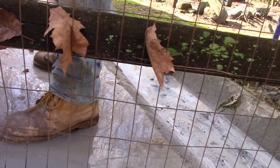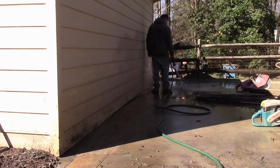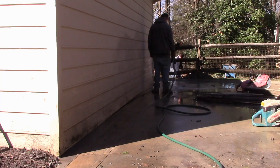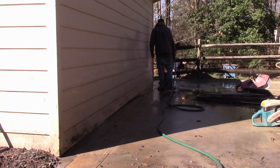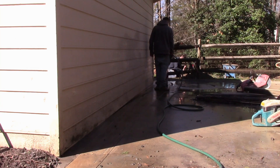Almost done cutting the concrete, just a few more feet. Once you've finished cutting your concrete, a real important step — take the time to go ahead and hose off your concrete area because it will stain. The little bit of dust that turns to sludge is pretty much just pure Portland cement, and when it hardens it will stain the surface quite white.